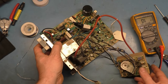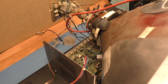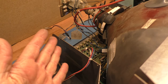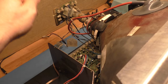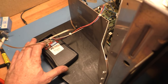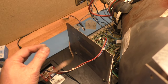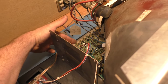So let's get this back on a tube and see what it does. Okay, back on the tube, all hooked up. We got our anode, neck, yoke, ground, power, video remote. I got all the color pots set to center, wiped them back and forth, and put them to center, which I always do for a nice good baseline, and we can adjust from there. TPG is hooked up just temporarily to see if it gives us a good video, if it does power up and work. We got power and everything, so let's just turn it on and see if it works now with everything that we did.